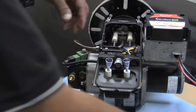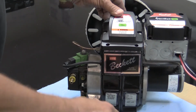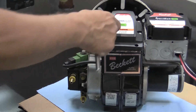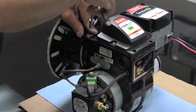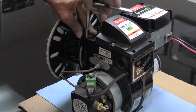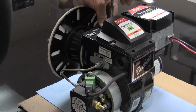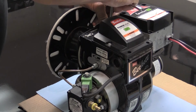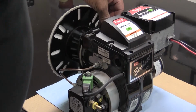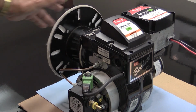With that being said, close the electronic igniter back up, flip the dog ears back in place on the electronic igniter, and make sure you tighten the screws back down to hold the igniter in place and not allow any exterior light into the burner igniter system. That is how you pull a burner maintenance on any of the Falcon 3 burners.